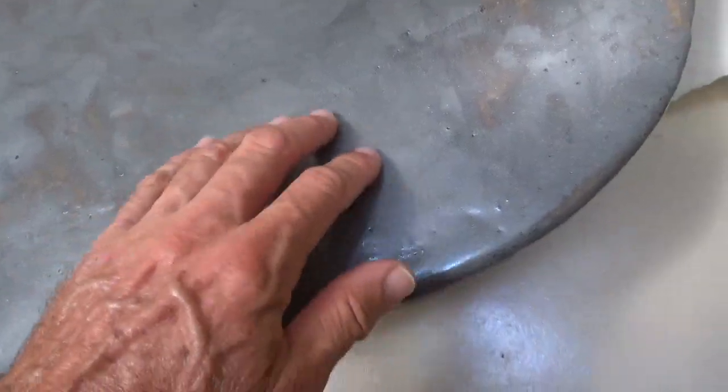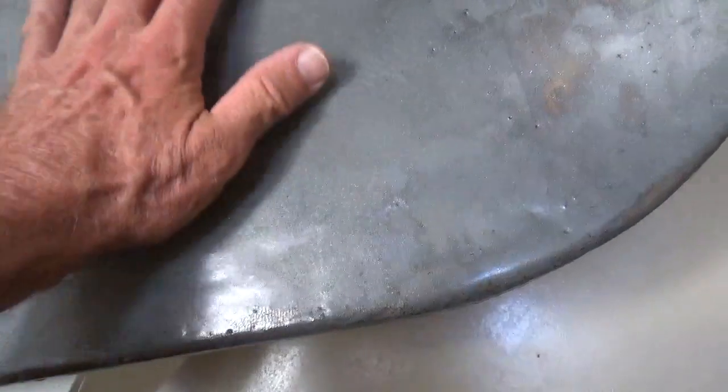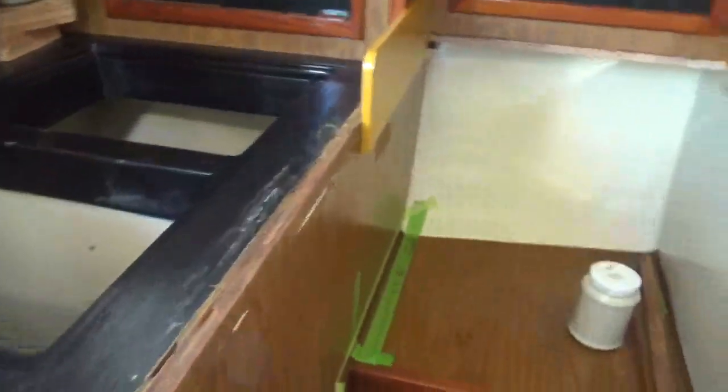This is the third and final coat of epoxy, and I used pigment this time — battleship gray powdered pigment — just to see how well it covered and if it affected cure time. It doesn't seem to. That was very successful.